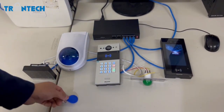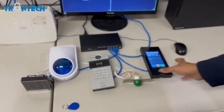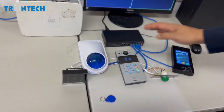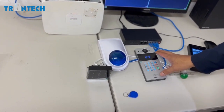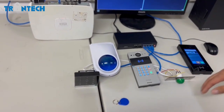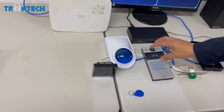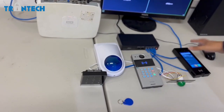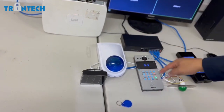I've got another door station here. The strobe is connected to this door station, and from this monitor I can send commands to that door station — so when we send a trigger it will open the striker connected to that door unit. Also, using facial recognition, I've set my face to this doorbell so when it sees my face it triggers the relay connected to that door unit.